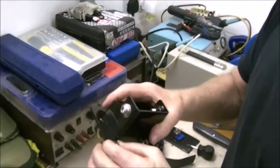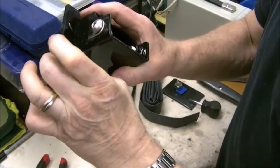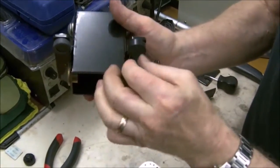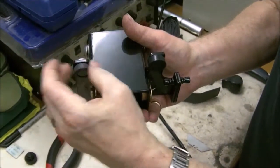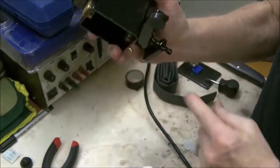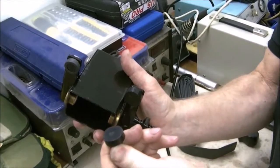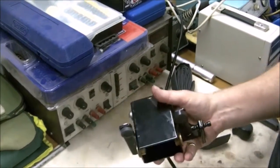The reason for 20mm wasn't an arbitrary dimension. That is the width of that flange bit there. And also, the reason for choosing this particular magnet, which is a 7mm, with the spacers and the heat shrink and so on, it comes out, believe it or not, at exactly the same depth as the standard rubber that's put on there at manufacturing. Look, there we go. Exactly the same.